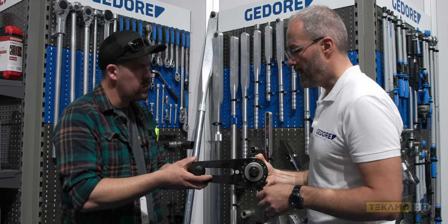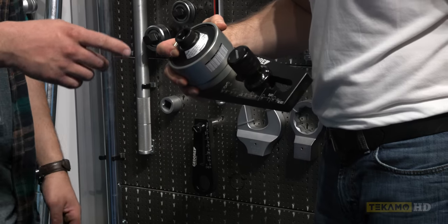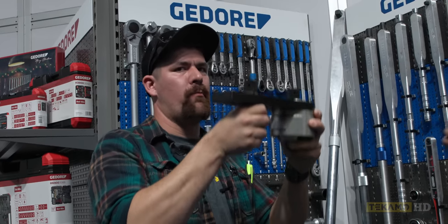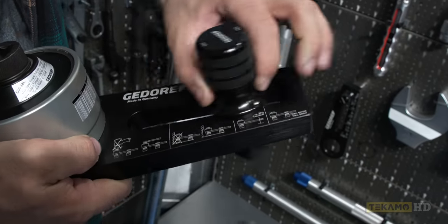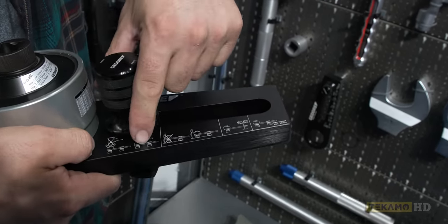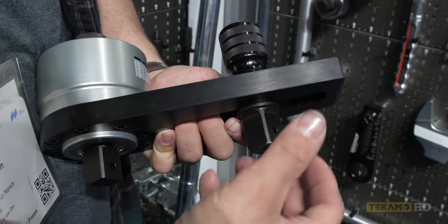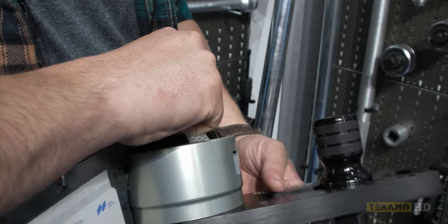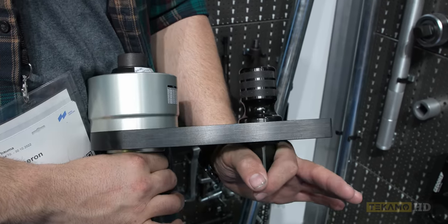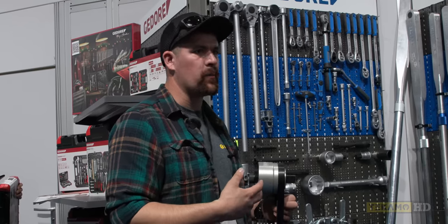This is the safety point — this is the normal reaction bar. Normally we have a system with a straight one. If you were doing like flange bolts, you get two sockets — put one on the one beside it, one on the next one, and you can slide this and index it wherever you need it to go. You put a socket here and place it on a pair of bolts. With any kind of torque multiplier, they need a reaction — this will spin but then it would just keep spinning. So you lock it using a socket on the adjacent bolt, and it reacts against that to torque the fastener up.